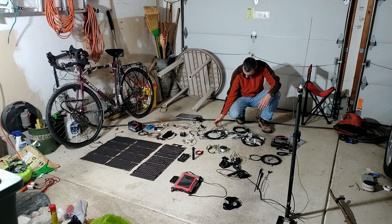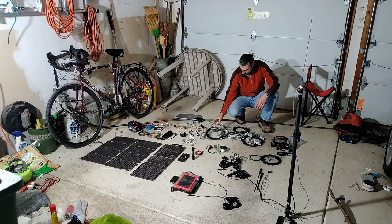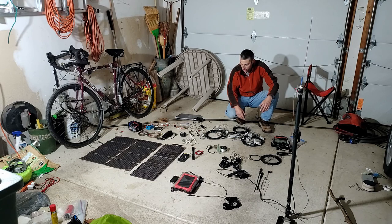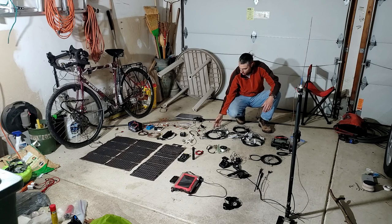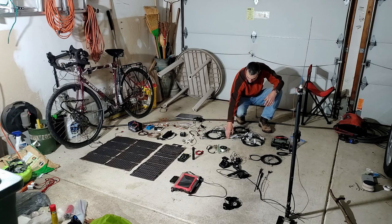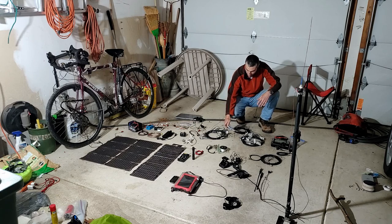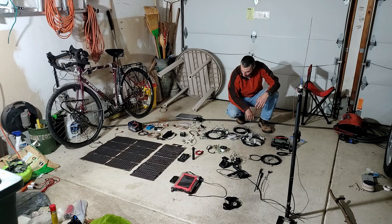All the white pieces on it, they're actually chunks of a cutting board. So I just got one of those big, I don't know if it was like 18 by 22 inches or whatever it was, size cutting boards, and cut all the pieces out. So those are my insulators. And then this is my center feed point. So it's just homebrewed ingenuity and nothing overly fancy.